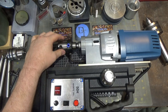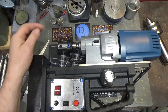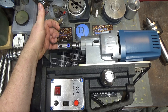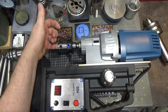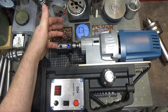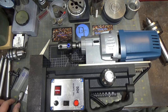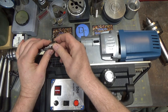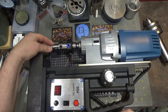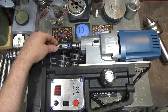Before we leave this tool I want to take a closer look at some of the issues with it and see if maybe they're addressable. When I reach inside this bore, the part that is ground for three-quarter inch is only the outside — maybe a quarter inch or less, that's six millimeters or less. That means the whole bearing surface for the ground surface to mate on is only about this big, and the rest of it is not actually meeting any material, which is why this thing slops around so much.